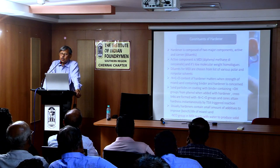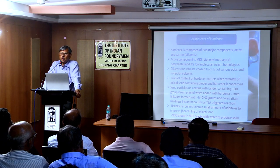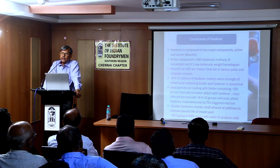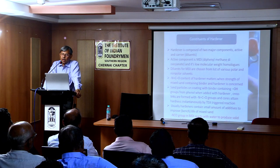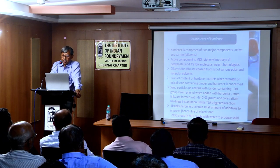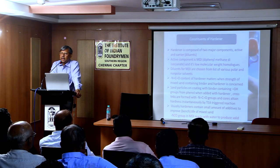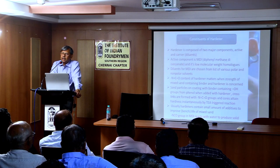The most commonly used hardener is diphenyl methane diisocyanate, MDI. It has two NCO groups, and these two NCO groups react with the OH groups of the phenolic resins to give a hardened mass, a cross-linked polymer. Here also MDI is quite thick. It is diluted with solvents.